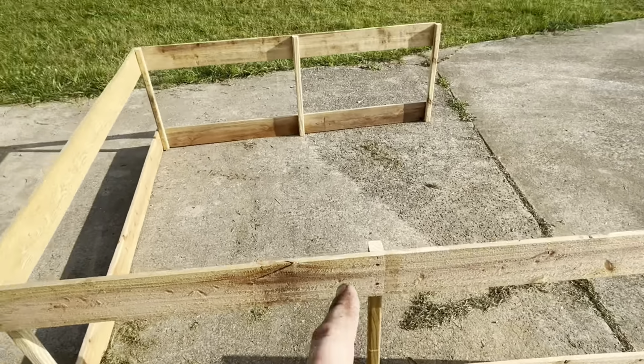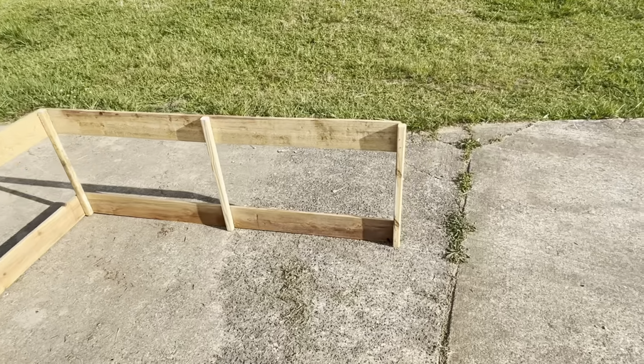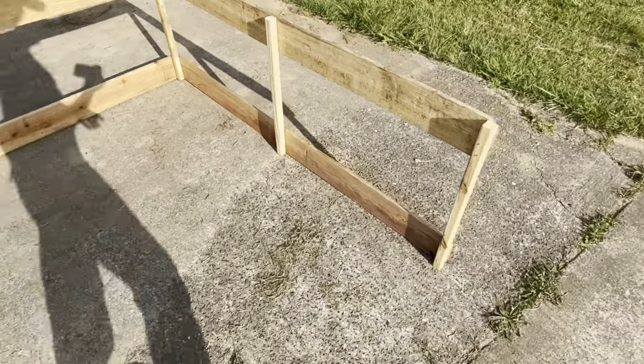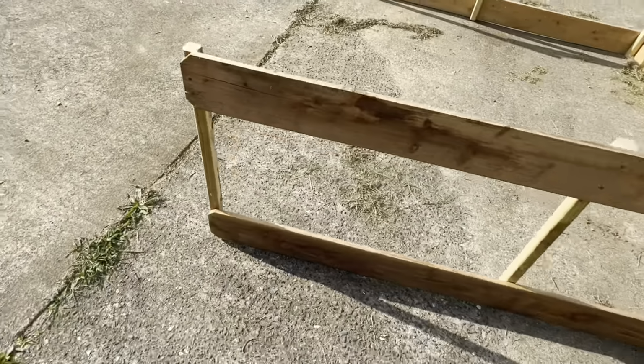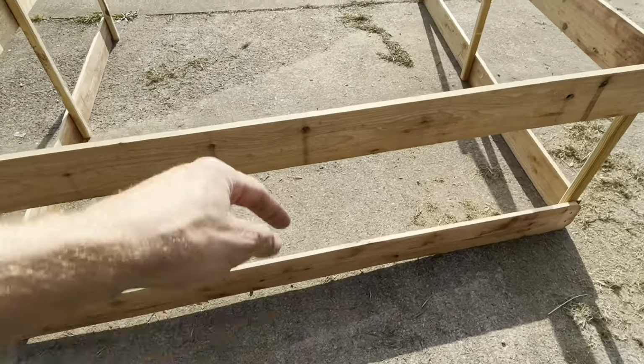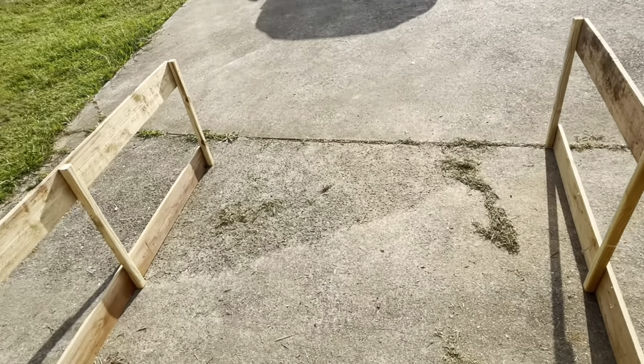So you lay these down, you build this wall twice. Okay, so you just lay the 2 planks down, put your boards, screw it in from the outside. Then you just add this board and that board. We're going to drop a center support there. This board, that board, center support there.